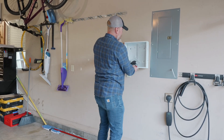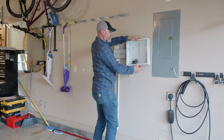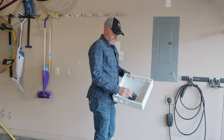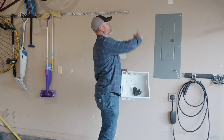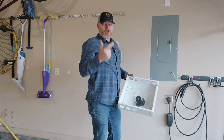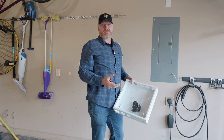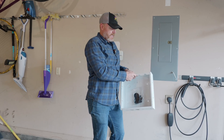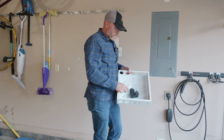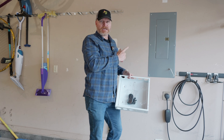This is just a 14-inch can — that's what we call these. We're going to place it right here; it's going to sit inside the wall and it's got plenty of access for all of our providers to bring things in. We'll cap off any of the other holes. We're also going to run a conduit up into the attic so that we can pull a new fiber along with a new cat6, because this home was wired before cat6 really was the standard. So we're going to pull a new cat6 over to our main panel inside the home.